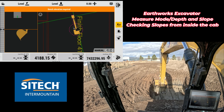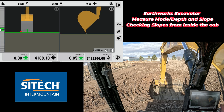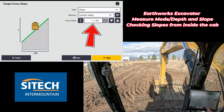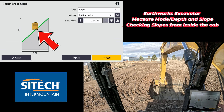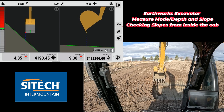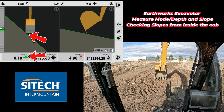To do the left side, I'm going to set my teeth right down at the bottom — left tip on the left side — and hit bench elevation. With cross section and profile views on screen, I hit bench elevation and bench out zero on the left side. Then I go to my sideways cross section, tap target cross slope, and type in a one-to-one. Pay attention to which direction it goes — you don't want it going off the right side. So I change it to a negative, which puts a one-to-one slope off the left side. It saves these so you can switch side to side. Now I've got an actual design slope, and running my bucket up to that marked spot you can see the slope off my left side that I can cut to — exact same spot, because it's one-to-one.